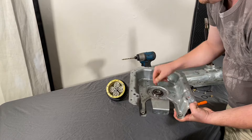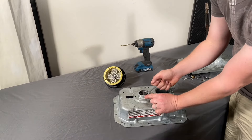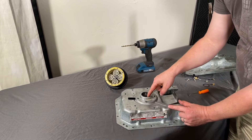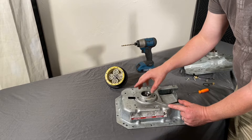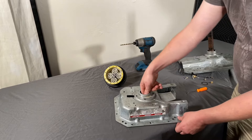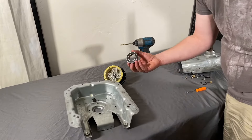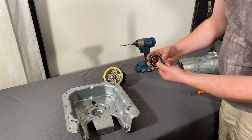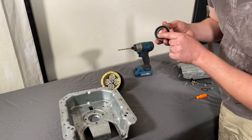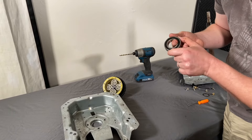You can start pressing this bearing back off of there. Pull this piece off — it'll be very snugly on there. Then flip this over. I took a large socket, sat it on top, and took a hammer and gave it a good straight-down hit. It took a lot of force to make it pop out, but it will eventually pop out. If you put a little WD-40 around and leave it for about 20 minutes, then WD-40 again and hit it, that might make it a lot easier. Afterwards it just falls out — it fits snugly but it's not welded in. Here is the first bearing. The bottom bearing is easily replaceable. This bearing number is 6006-2RS, and on the other side it says B as in boy, H as in Henry.